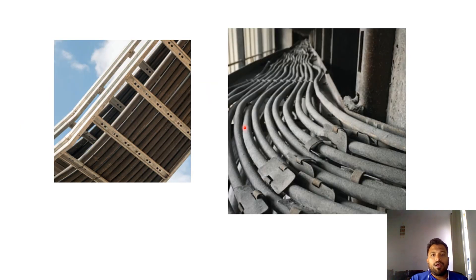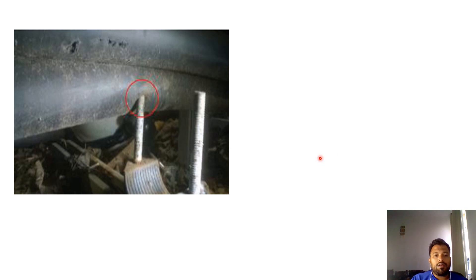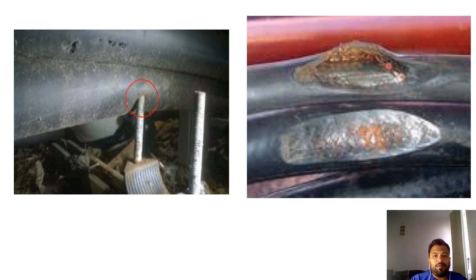During a short circuit, if the cables are not properly secured — for example, if we are only securing with cable ties — it is not sufficient. During a short circuit, a force will be developed that may cause damage to the cables. If these cables are carrying current and an adjacent person is nearby, it may cause electrical shock and their life is at risk. That is the reason we require cable cleats. Short circuit means conductors are unintentionally contacting each other or external factors, causing cable insulation damage.